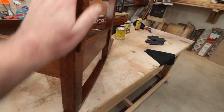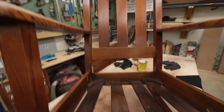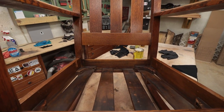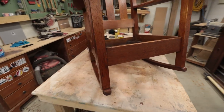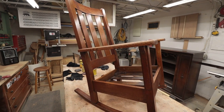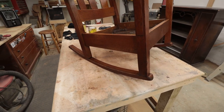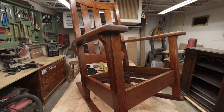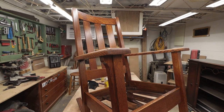I mean, you can see right there, it's almost dry, and this has been sitting maybe 5 minutes. So we're going to let this continue to dry and then do one last step with that restore finish. That restore finish is basically stain with some solvents and different things in it. I'm not sure of the mixture on it, but it's not far off from a stain. So I figured maybe one extra pass just to give it a little bit more color wouldn't be a bad idea. So we'll let that dry and give it a hit with that restore finish then.